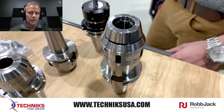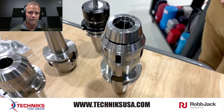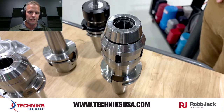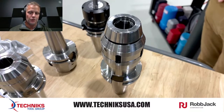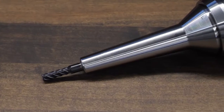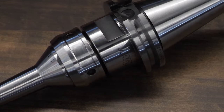I like to think of the micron milling chucks as really a mechanical version of shrink fit. You get all the benefits that you would with even the heavy wall shrink fit in a micron milling chuck, or our mold style chuck, in terms of holding power, in terms of accuracy, and then with the mold style chuck, even with the small nose diameter, allowing you to get down inside of pockets or in five-axis machining.